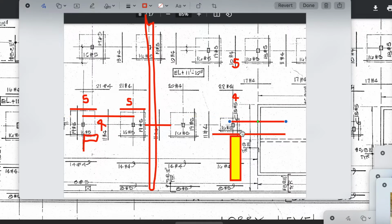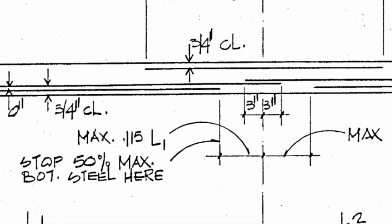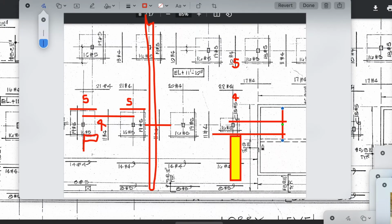And I'm stating that this being close to here creates a more rigid plane out to, well, at least a critical shear zone. 100%, because that's the way you do these capital heads, these cap heads. So it's like a bracket, if you will. It gives it rigidity there. And then the transition happens from here, where you get your deflection. Of course, the steel on the bottom is being pulled. But now I'm going to take some liberty.